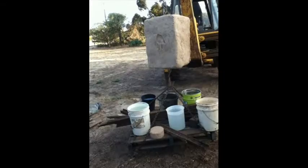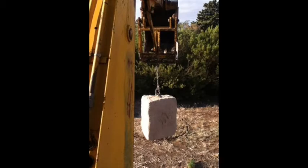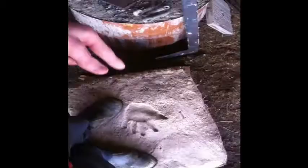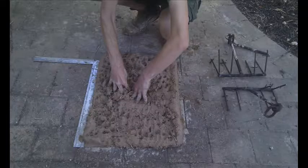This is a test cob block — that's what I call it anyway — that I made as part of my research project. My attempt with this was to demonstrate the structural properties of cob. I planned a test where I would rip apart the cob block and see how much weight it would require to do that. I attached a pallet onto one end with a chain that would attach onto this loop here, which is embedded in the cob.